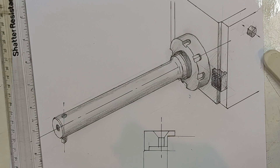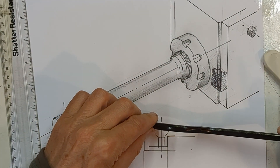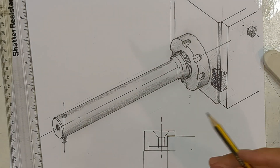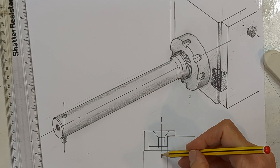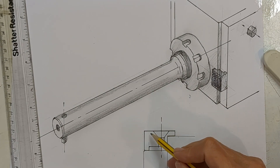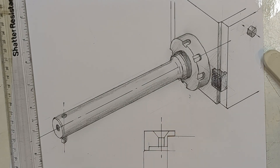The reason I put a countersunk screw in there is because I want the C-spanner to come over the top of it and not foul, so socket head cap screws wouldn't be appropriate. I've also kept this section as deep as possible because I'm going to use the clamp to drill through for the tapping holes into this material — effectively using the clamp as a drill jig to make sure I get the spacing correct. So that gives an explanation of the shape.